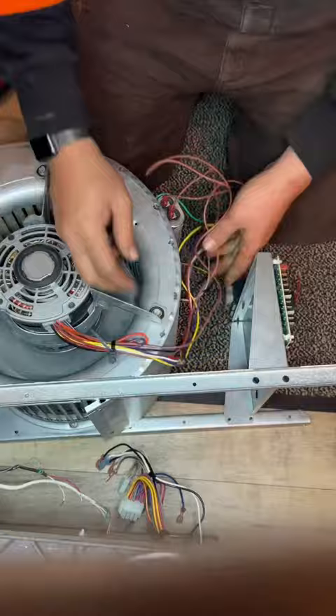With these rescue motors you only need to keep about three of them in stock as opposed to 20 of them. We are able to use the same mounting hardware and bracket. Some jump wires to make sure we've got the correct rotation, then we work on wire management and get everything put back together.